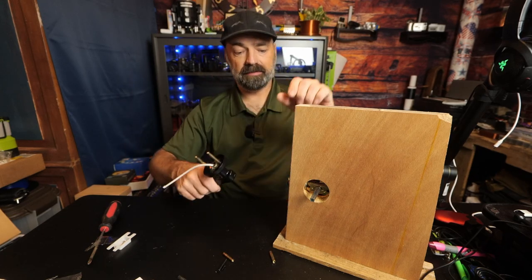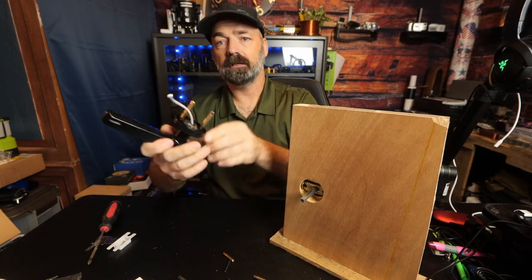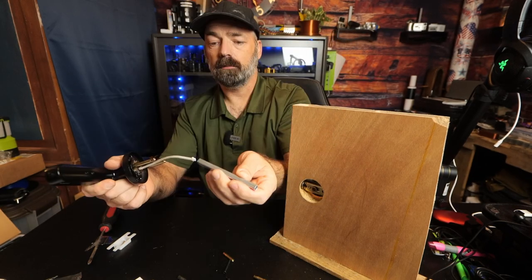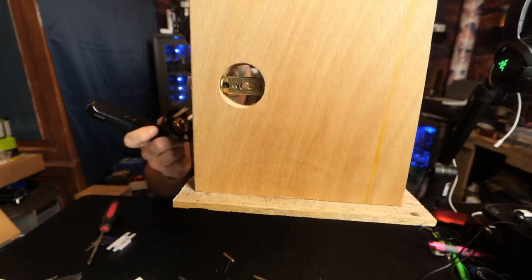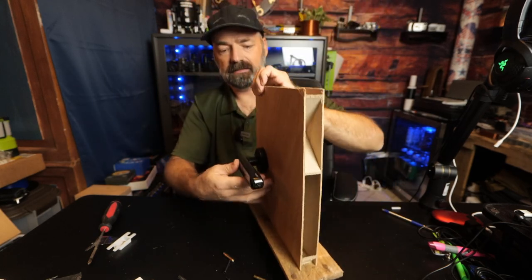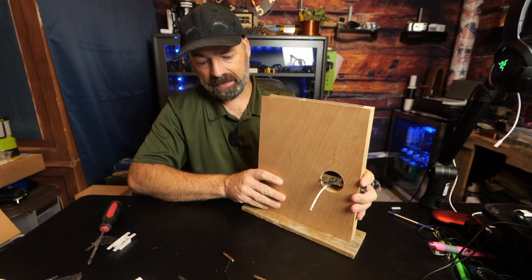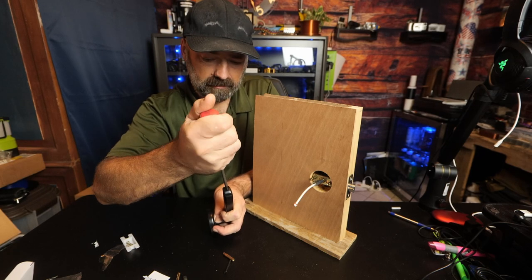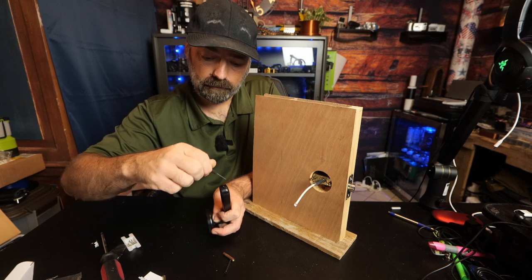This piece goes on the outside because that's the way the door swings. You're going to guide the wire through the center tube — just pull it out and feed the wire through the square hole in the middle, then slide it in. You can see it's in on this side, and this is what it's going to look like on the inside. Now there's a little Phillips head screw in the end of the handle on the interior side — just take that screw out, or use the one they provided.